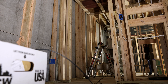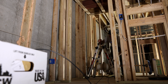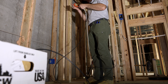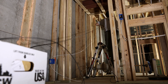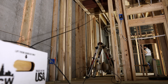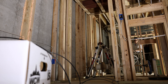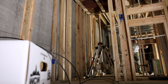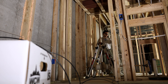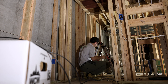Here is your first couple runs. Now what I'm going to do is build the head for the next run, which is for the master closet and for the access point in the hallway. We're going to get away using a U6 Enterprise access point - it's got a little bit more power. We can even go to a U7 now, but we only need another two wires up top. You always want to make sure when you're pulling Cat that you don't have any kinks in it. Now that we're done with the second floor, I'm going to cut these off and tape them as one bundle.